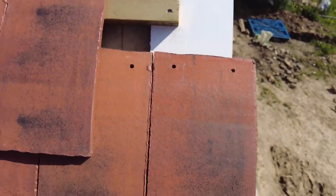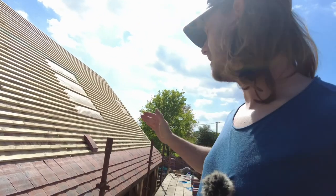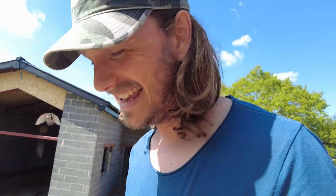I worked out the under-cloaking based on the tiles being 165 millimeters wide so they'd fit exactly without cutting — but I got that totally wrong. These tiles aren't all 165 mil, and you're supposed to have up to a 3 mil gap between them. So the tiles finish wrong at either end, going about 30 mil past the under-cloaking on both sides. Me and Dan had a debate — he wanted to butt all tiles up and cut one side; I wanted to keep it symmetrical.